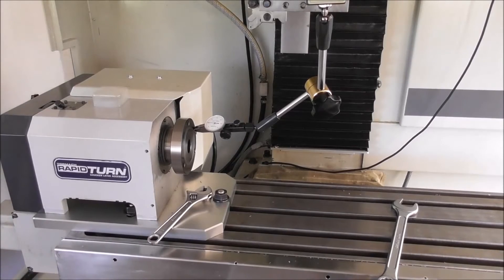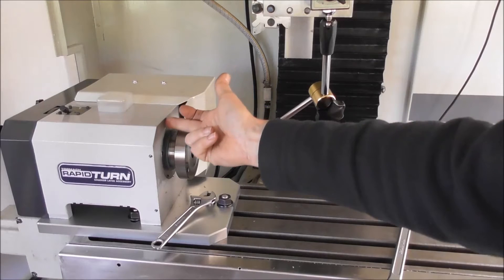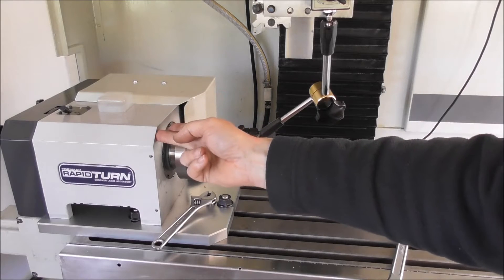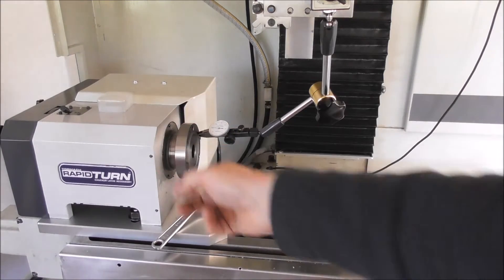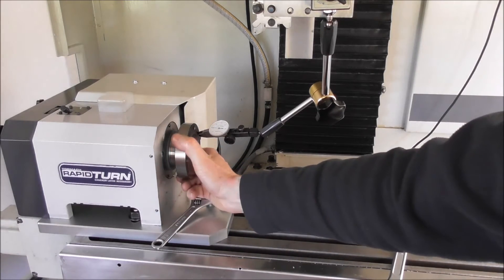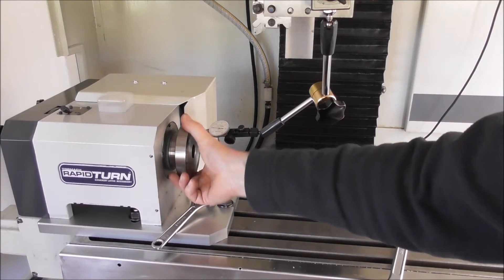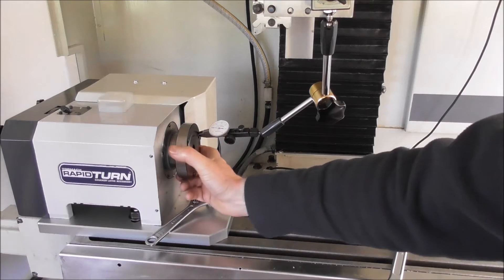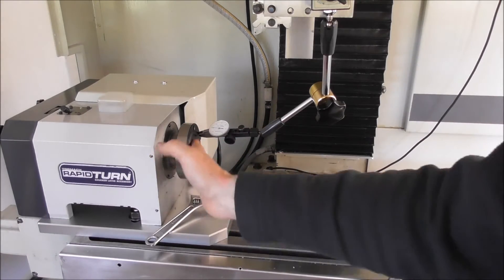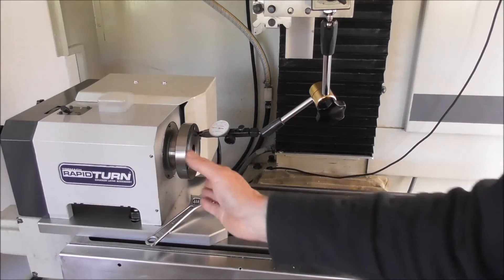You can pop in a couple of shorter cap screws just to retain the guidance and come down the rest of the way — you're just going to crush the expanded polystyrene rather than cause a jam and strain to the ball screw system. They work well. The Tormach manual says to clock the headstock in alignment by working on the machined face on the end of the headstock, but of course that relies on how accurately that surface is machined. It's better to take it off the front face of the adapter flange, because you can check that it's perfectly concentric by rotating the spindle. Then you can machine it with a tool — take a couple of thou cut to get it exactly true.